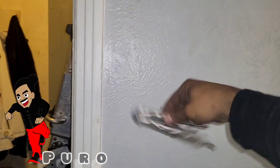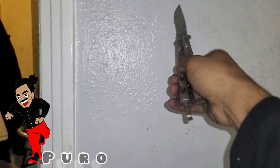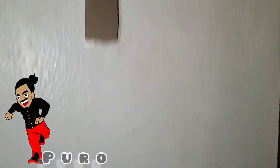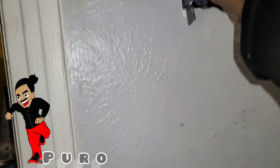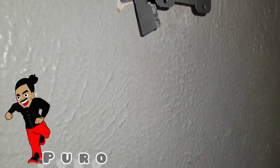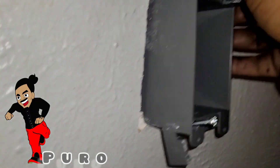I like this height. Typically you want to use a sheetrock knife to cut out a square, but I'm going to use my trusty butterfly knife to get a hole started. I got my box cut out — perfect size for this. These tabs are going to catch and hold this up. You don't have to worry about cutting it a little too big because you're going to have a face plate that goes over it for your switch.